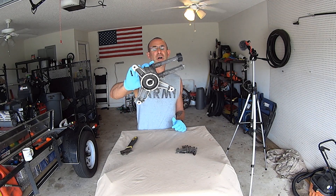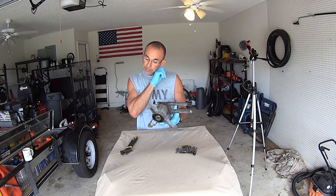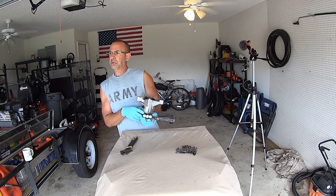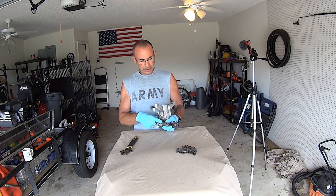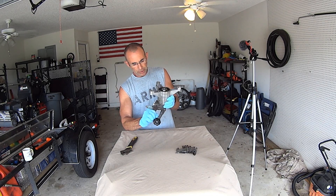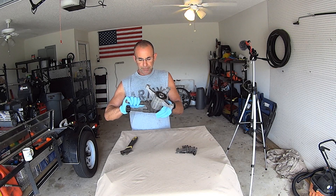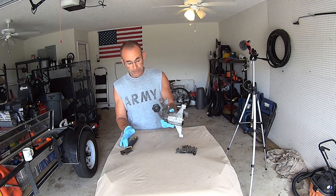This is a three-legged type pump. The model number is SRMW 2.2 G26, which is also pretty much the same as the 2.2 G24 — 2.2 gallon per minute, roughly 2500 PSI. The housing is cracked on the top here. The way these things mount, you roll them around with the garden hose and pressure wand connected — there's a lot of torque on these cheap things and it's a weak point because it's drilled and tapped right here.